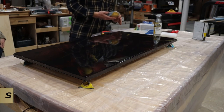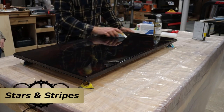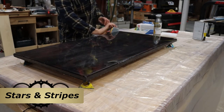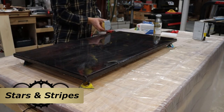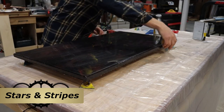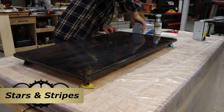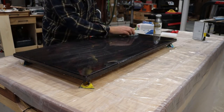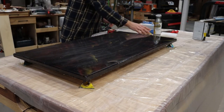After the resin cured for 72 hours, I took a sanding block with 220 grit sandpaper. Basically, what we want to do is we want to create a mechanical bond for the spray paint and the resin going forward. Just light passing, we knock down some of the little nubs, little of those dust bunnies that get in the resin. Don't really go hard here, but just make sure that you're careful on those edges. You don't want to eat through the resin that's actually on the roundover.